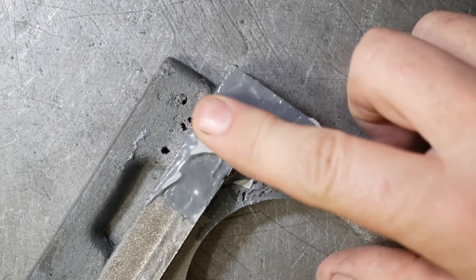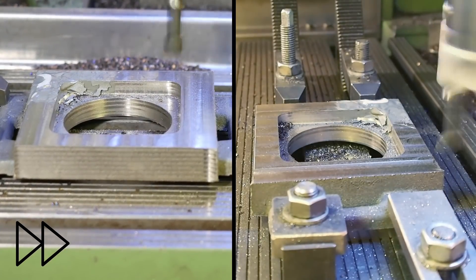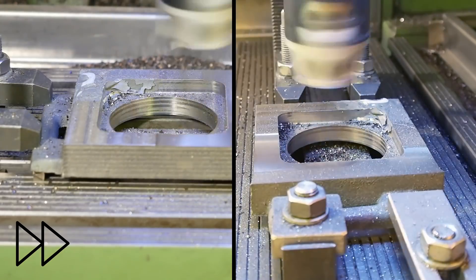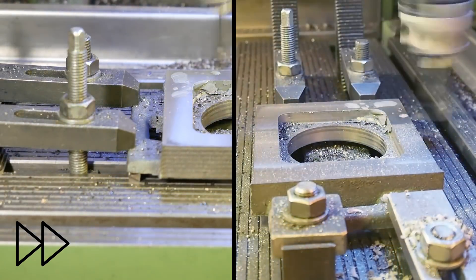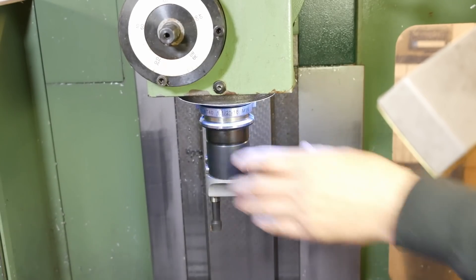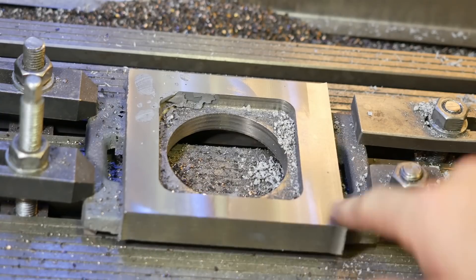So what do you think that's going to look like once it's machined? Since you might be wondering, my face mill might be too big for this job at 100mm, and my next size down is a 20mm. I wanted something in between, so I decided to try out the boring bar as a fly cutter, and I think it did pretty well. Slow as molasses, but it does make a nice surface finish.